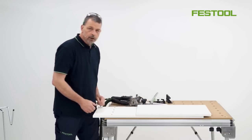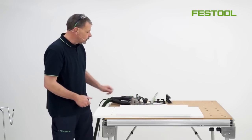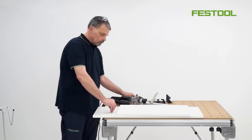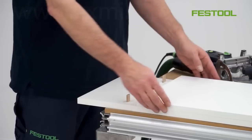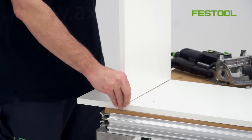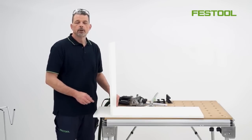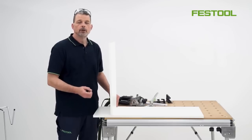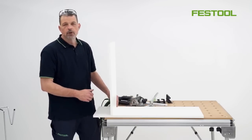Now when we take what would be our shelf across the board, we've got the four initial cuts, and then the four cuts I just made will also line up into position. The dominoes can go into the slots we just made. We can bring the two components together, and the big advantage is that we achieve a flush finish on the face edge of the material. With reduced marking out, we can work quickly and efficiently using the domino jointing system. That's fixing a shelf into any position along the side of the cabinet.